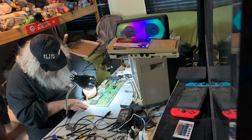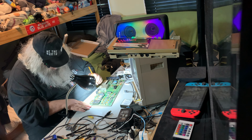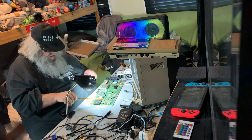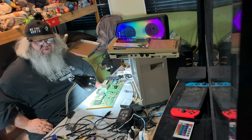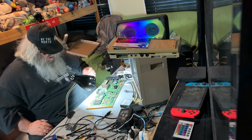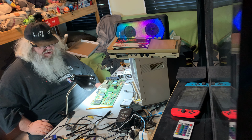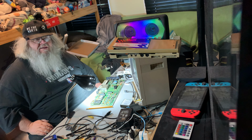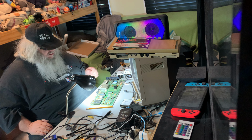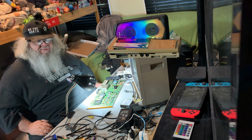Anyway, I waited until the phone was, I let it go dead. Absolutely dead. And then, according to the instructions on the DeoxIT, I did spray into the charging port while the phone was off, and I did then work a cable in and out of it a bit, and did that for a couple of minutes, and then sprayed it again, and then worked it in and out a bit, and then left it to dry.